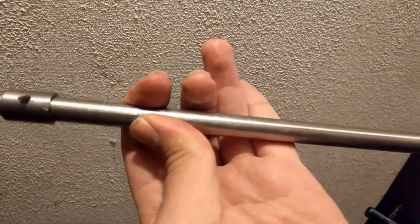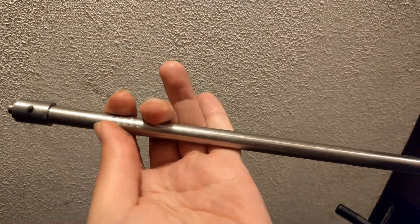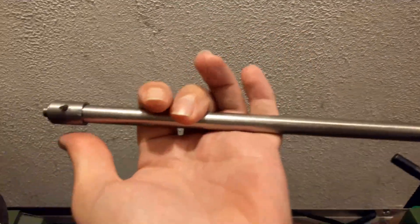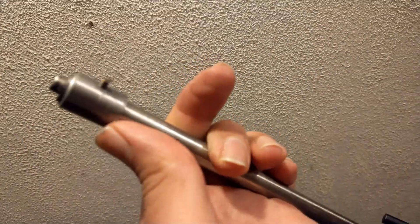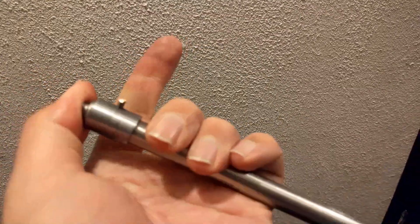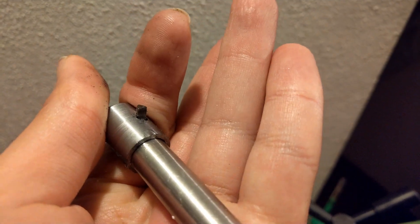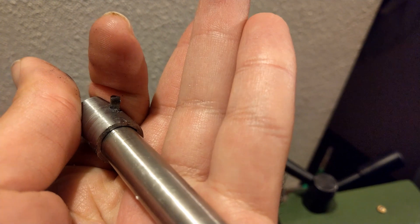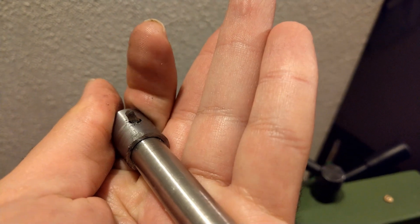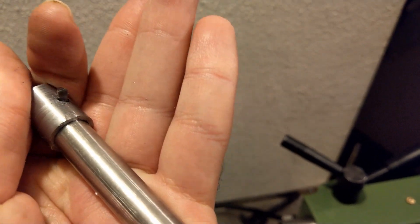I made this piece of tooling — it's just 12 millimeter stainless steel. I drilled into it and I can place a piece of drill bit in there. I shaped the drill bit like a carbide tool and made it very sharp, so basically I'm going to take slightly off with this tool.